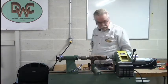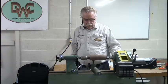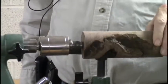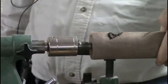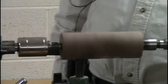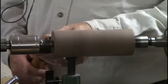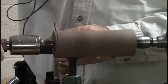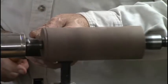So this is the process we use. We start out with the top first. I'm just going to put a tenon on this so I can turn it around. This is a piece of scrap wood — you can see it's got a nice defect in there that I can't really make into anything else. We'll use this part here. I'll just put a little tenon on it so I can mount it in the chuck.